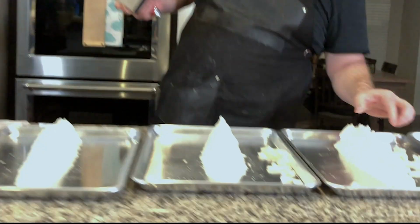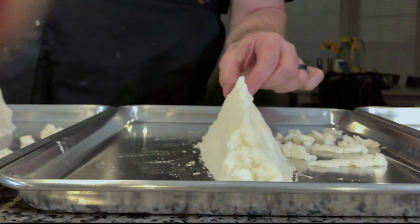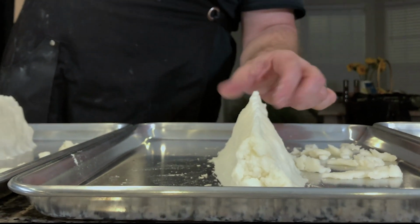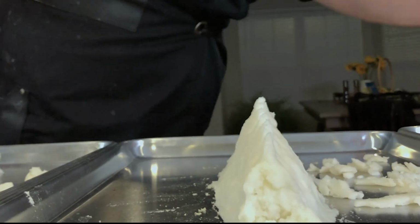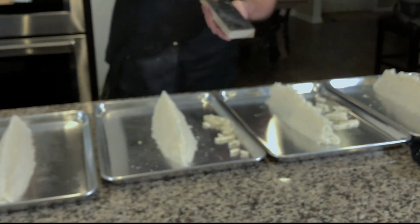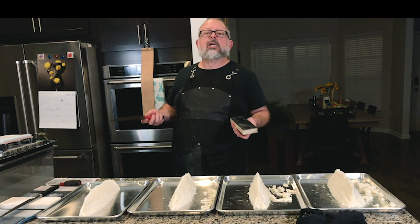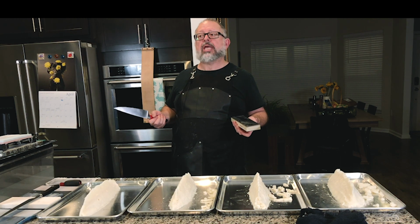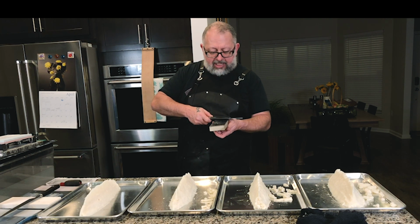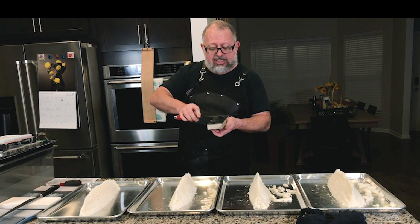That's when we're going to want to take it and use a strop. Once we rip it off, when we get all those things off, we're going to put diamond emulsion on it, and we're going to use something like 0.5 micron, and you can even go down to a 0.25 micron.